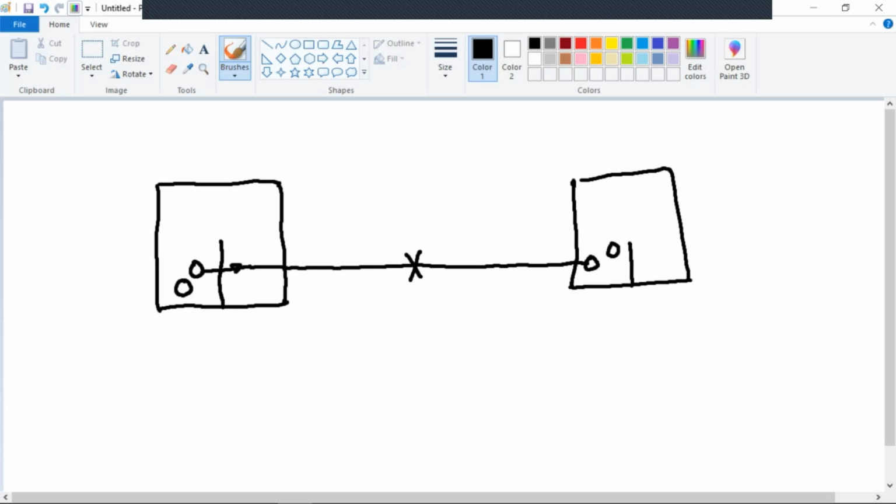What happens? All three have to come out. And you have to scrap all three phases. Once you've pulled conductor out of a conduit, you might as well just go ahead and throw it away. Professor V, have you ever reused? No. Same thing. Pull it out and scrap it. You're going to have to pull in three brand new phases.